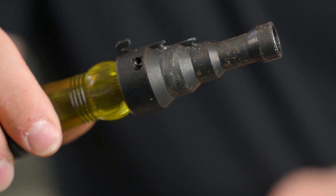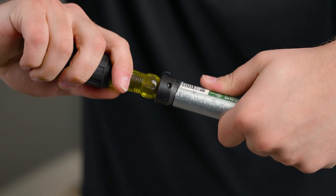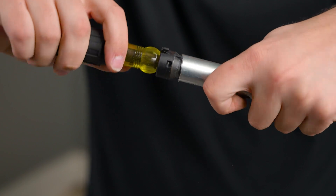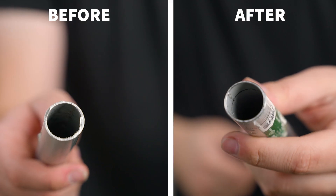It's designed specifically for EMT conduit and has hooks for half-inch, three-quarter inch, and one-inch sizes. Basically, you just slide the conduit over it until the conduit edge is hooked on the appropriate size hook, and then you just rotate it around. It takes a lot of energy, force, and time to deburr it, but it does work after a while — though you could say it barely works.